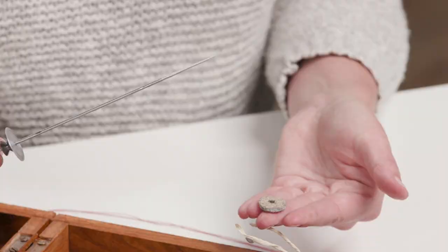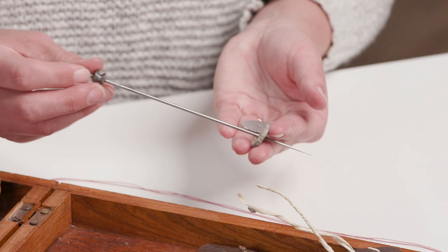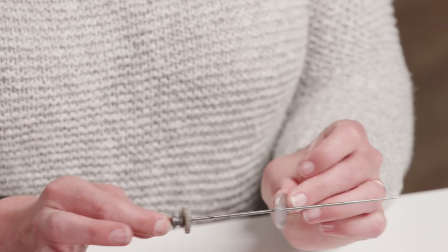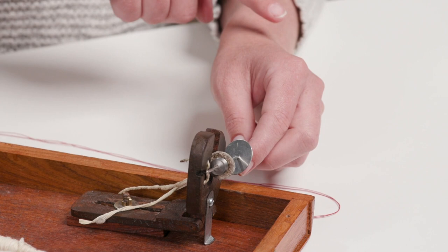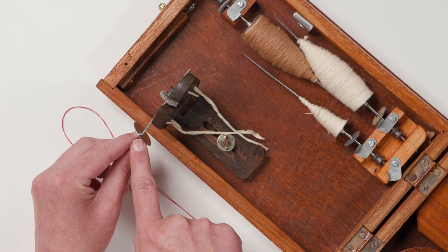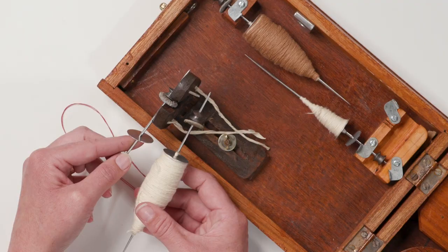That is holding on the yarn stop. The reason they're loaded in that order is because the leather bearing holds it in place, not because that's the order they need to be in when you're spinning. So what we're actually going to do is put the leather bearing on first so that it's against the pulley. Then the metal yarn stop goes on. The yarn stop is on the outside because that's going to keep our yarn from pushing against the spindle stop — you have something to build the cop of singles against.